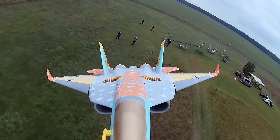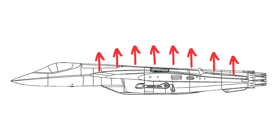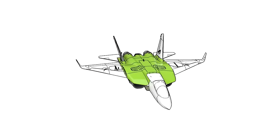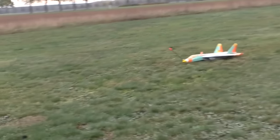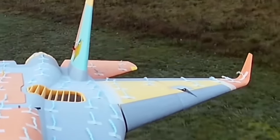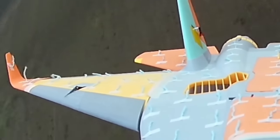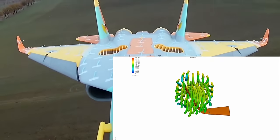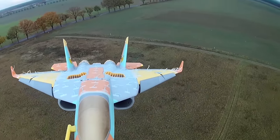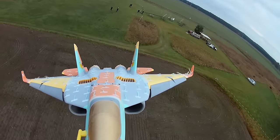And right after this first test flight, we decided to mount the front camera of the fuselage, which is designed as a lifting body, here visible in green. By the fuselage, so even smaller wings work absolutely perfect. Especially on the winglets, it looks really equal to the computer simulations. Air becomes turbulent on the outer wing and even at the trailing edge, but there was never a stall tendency or spin tendency of the JRM. As next, the droop nose has been extended, and this brings the slow flight again to an absolutely new level.